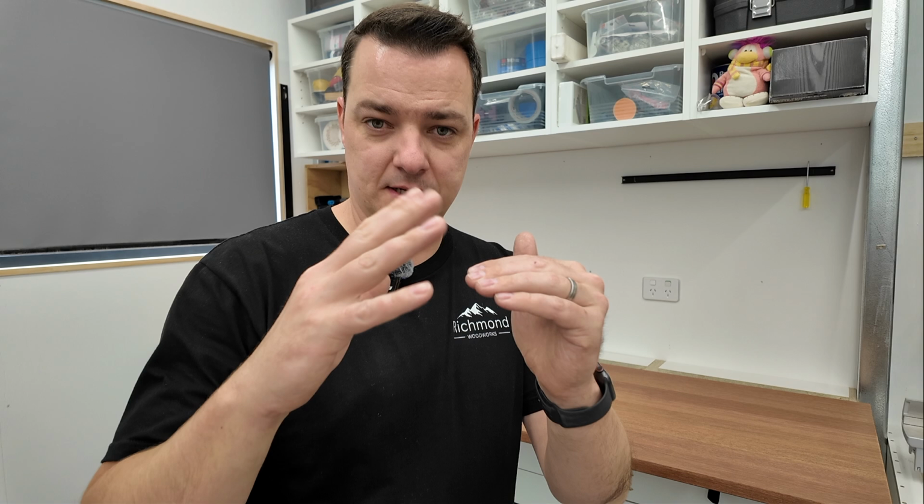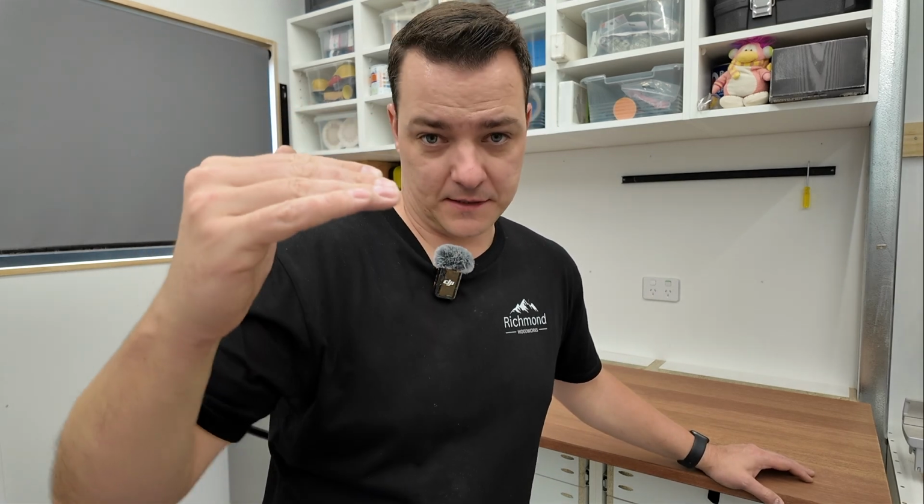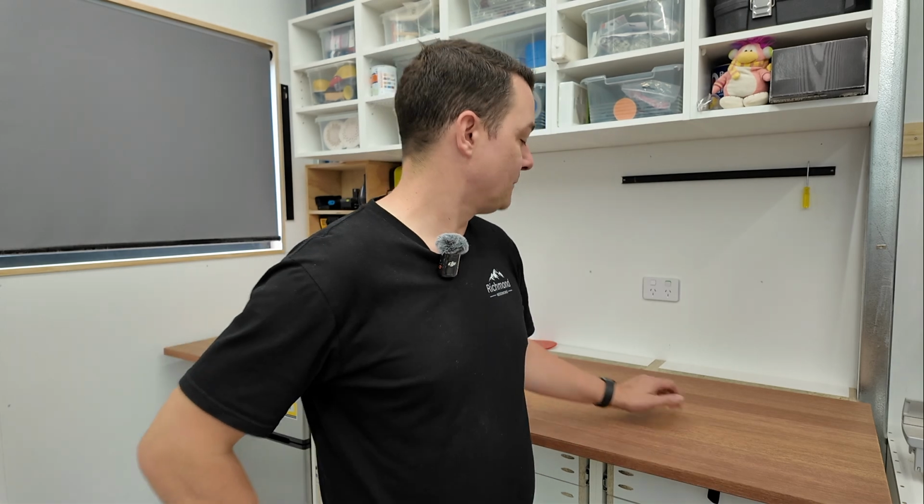What we need to do is have a wet rag, and what you do is just go over the timber itself. And what happens is that the grains of the timber start raising up a little bit. So it's very smooth to touch at the moment, but after you wet it, you'll feel a little bit furry. And then you get something like 400 grit, and just with a hand sander, you don't need to do a lot. Just have a very light pass, and then you wait, you dust it off, and then you wet it again, wait for it to dry, and then you sand it off again. You can do that as many times as you want, but probably not as many times as you want, because eventually you'll start going down to the next layer of grain progressively, and you want to avoid that. Otherwise, all you're going to be doing is raising fibers and sanding it down, and then you'll be left with a 1mm thick slab of timber. But anyway, so that's what I'm going to do now. So we'll cut to it.